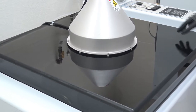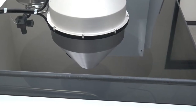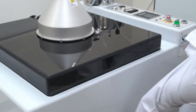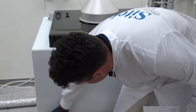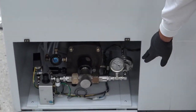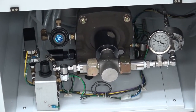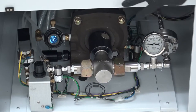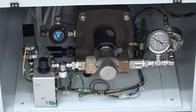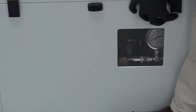We now have the spray arm oscillating back and forth. The spray arm is set for a 60 second clean. Taking a look at our high pressure pump area — beneath here is our high pressure pump. You can see through the window that we're running at 1500 psi, which is a standard setting for this type of system. In here we have a variety of valves and interlocks that have been calibrated to run the system properly, looking to ensure proper flow, proper pressure, and correct facilities so the system doesn't run dry or have any malfunctions.